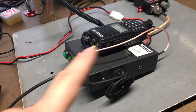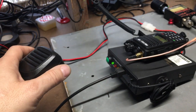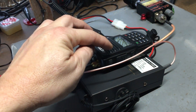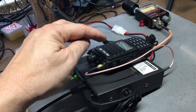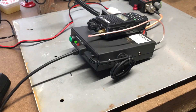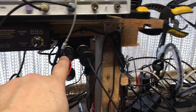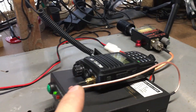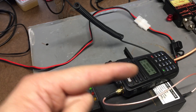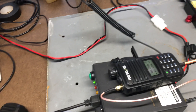There are two ways you can hook this up. You can use the microphone to key up the radio and listen to the speaker underneath, or if you unhook the control cable you just use the handheld to talk and listen. The volume control on the handheld does affect the amplifier volume. I have the amplifier and radio plugged into a 12-volt DC 30-amp power supply, and I'm using the Retevis RT85 handheld programmed to the repeater — a stock Retevis RT97 set up in simplex mode so it records and plays back my voice.